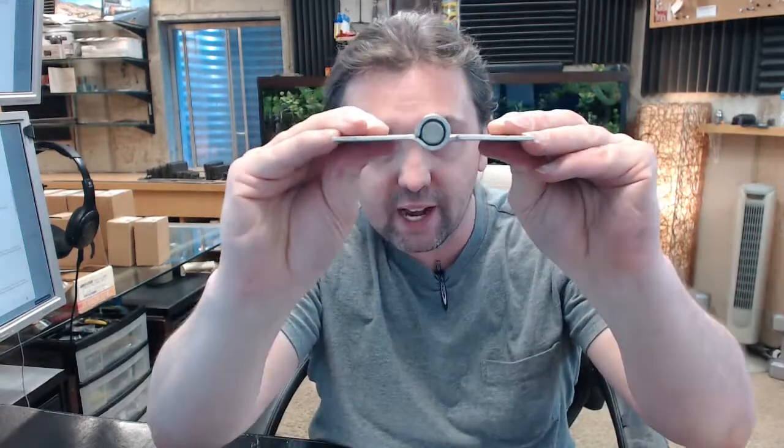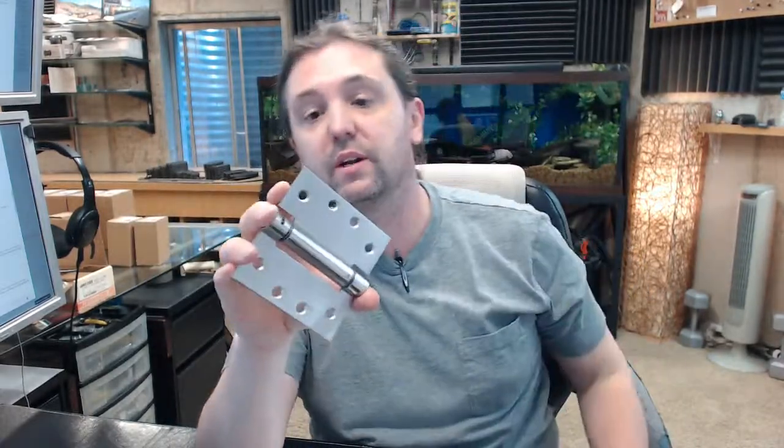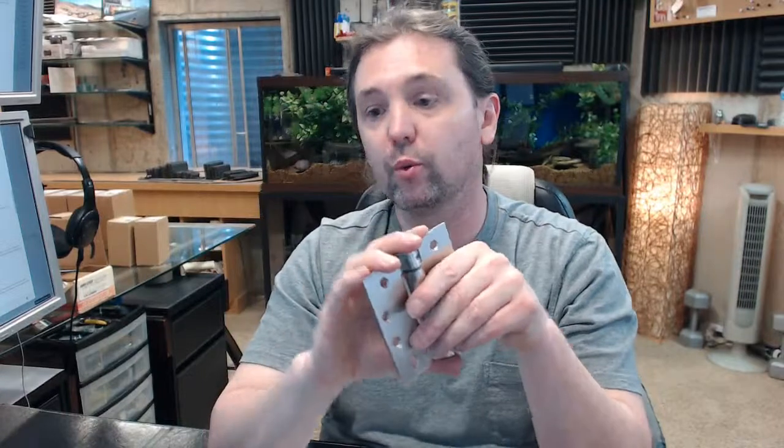So this is full mortise. You can see from the swag on the hinge leafs there that when the leafs are brought parallel, they're meant to be mortised flush to the edge of the door and frame. This is UL listed for a fire rated application, and that would be in your home. If you had an attached garage, that door is typically fire rated. As a rule, I believe it to be fire rated. This would comply with fire door requirements of it being self-closing.